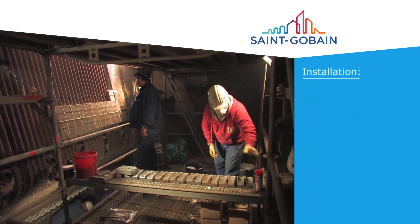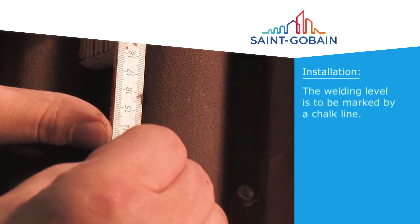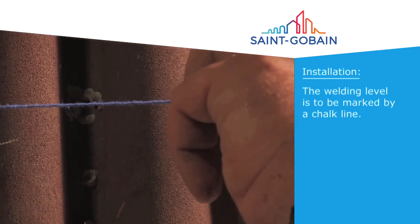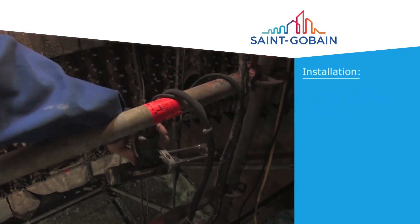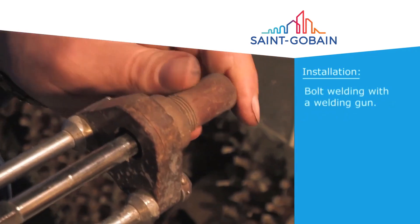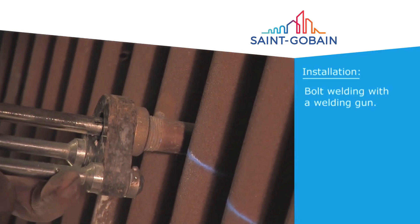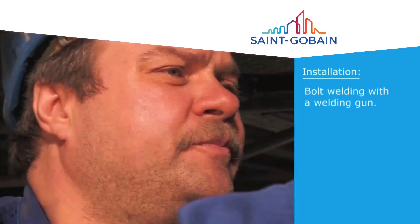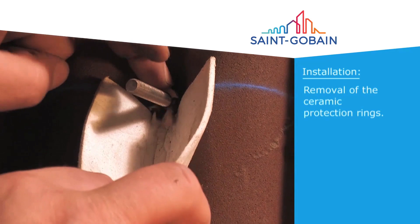To mount the tiles, the anchors must be fitted at the prescribed centers. First, mark a horizontal line with chalk or any other suitable method to ensure level alignment. Anchors are applied quicker by stud welding. Insert the anchor and the supplied ceramic shield. Weld the anchor into the position marked on the membrane, then remove and discard the ceramic shield.